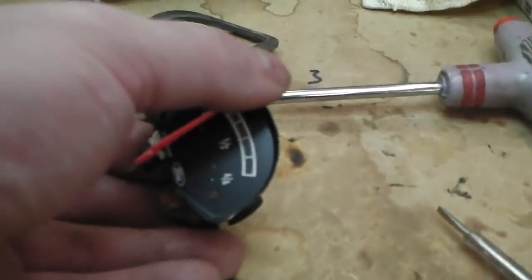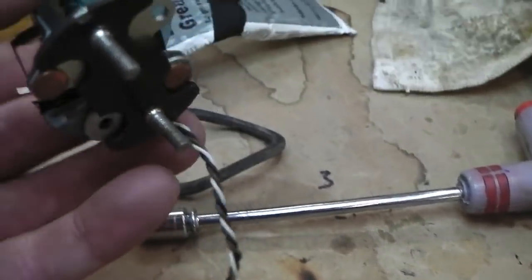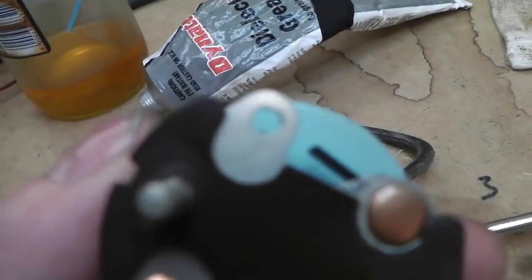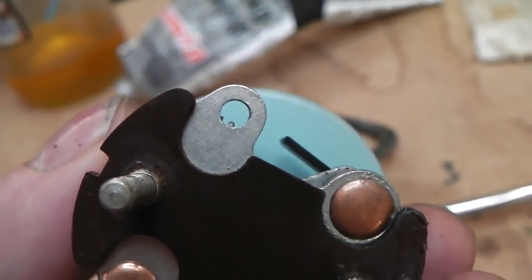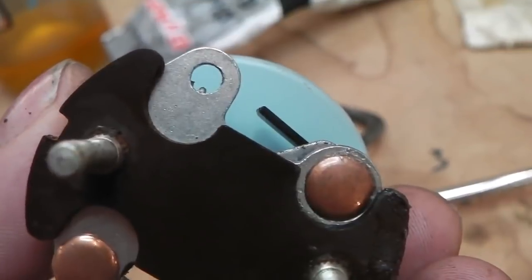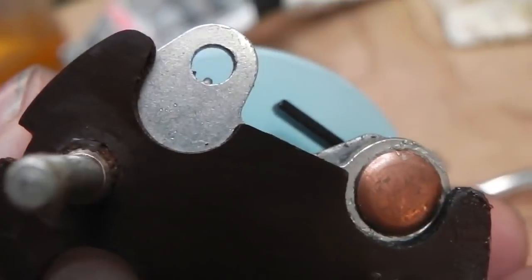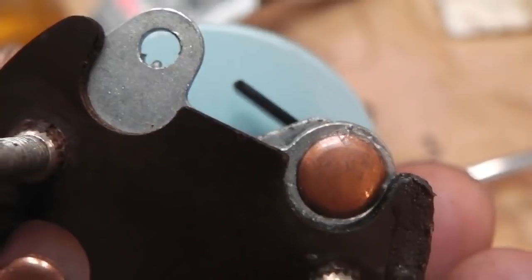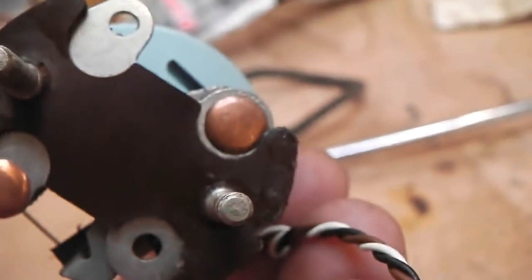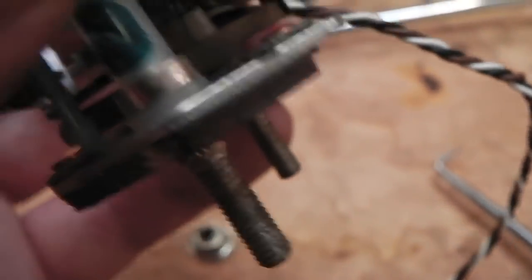Over to the bench we go. I'll show you the calibration adjuster. Flipping it over. Just at the top there, almost in the middle of your screen now, is a circle. Can you see those cogs? Those little teeth? You turn on those. I'm going anti-clockwise. I just put a screwdriver in there and pull the teeth just slightly across, and that gives us a bigger deflection. It actually connects to the mechanism there.